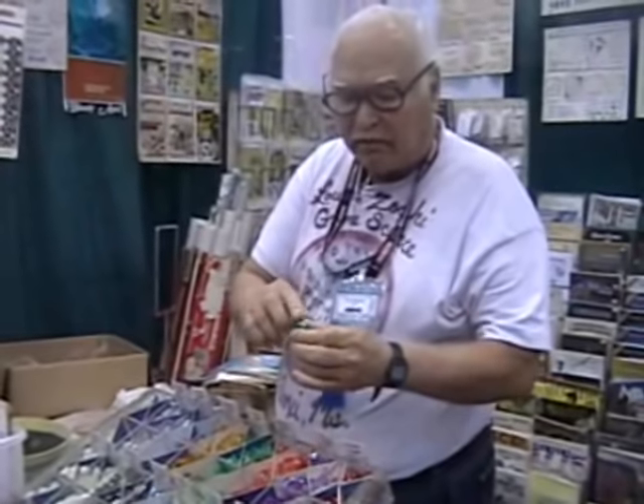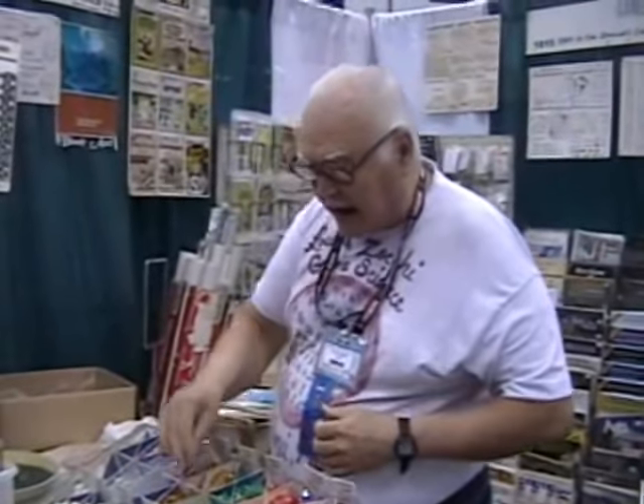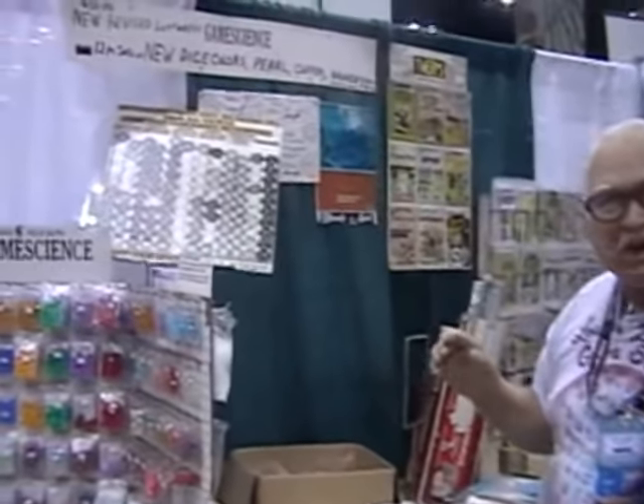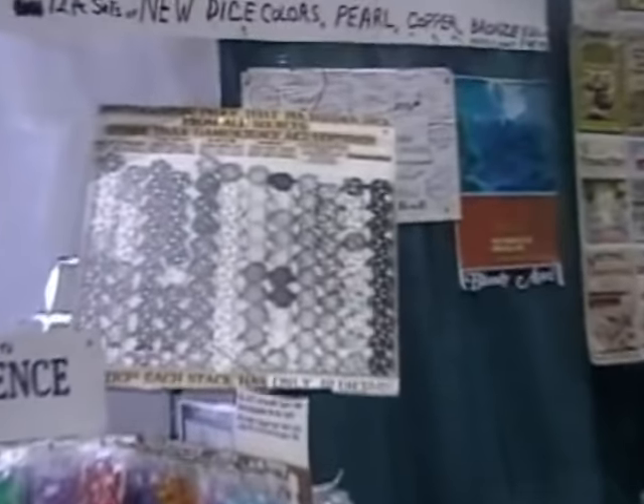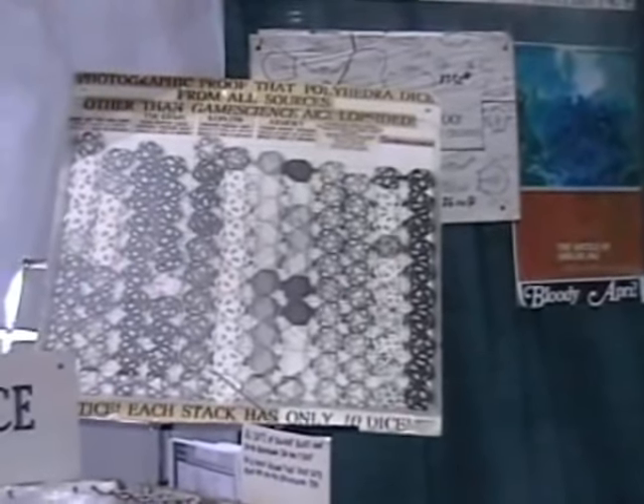After the dice have dried, they're put back into that same rock polisher and tumbled again, because you don't want all that paint — you want a contrasting color only in the digit. So the second tumbling removes all the unwanted paint from the outside. But at the same time, it's destroying all the edges and removing the vertices. When the dice finish that second tumbling, they now have blemishes, scars, and unsightly scratches all over the surfaces.